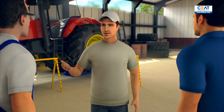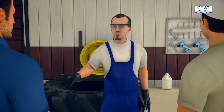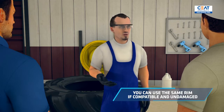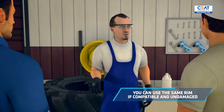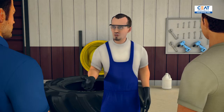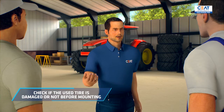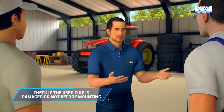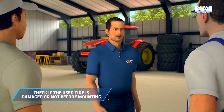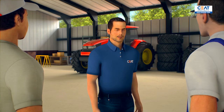But what if I need to change the tires later? Can I still use the same rims? Sure, but like I said, only if they are compatible. Just be real critical with the rim — it mustn't be damaged. You can keep reusing the rims as long as they are intact and have kept their form. And vice versa, if you're mounting a used tire on a new rim, check that the tire is not damaged. If it is, you have to get it fixed before mounting, one way or the other.